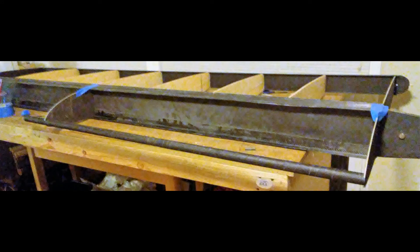I'm sorry to say there are no pictures of the finished part itself. This photo shows it bonded in place on the section of the wing I'm using for structural testing. You can see the root end fitting which has the alignment pin as well as the bolt hole for attachment to the test stand. In this final photo you can see the rear spar in place and how the C-shape allows insertion of the trailing edge ribs as well as an attachment surface for the aft wing skins.